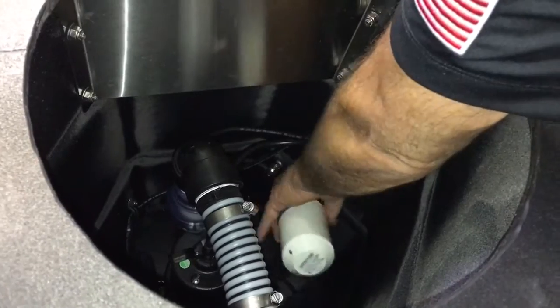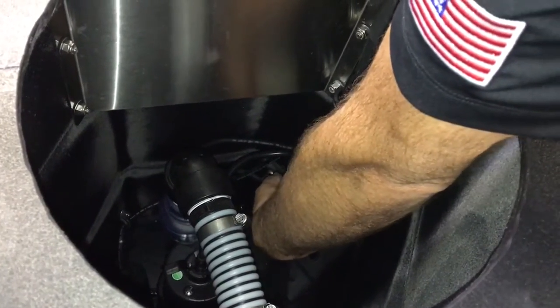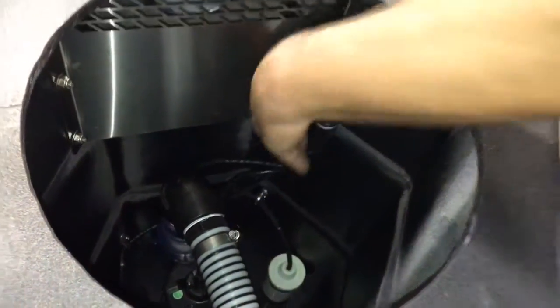On the right here, this is a shutdown switch. It is wired into the vacuum system itself, and if for some reason the pump out fails or can't keep up with the volume, to prevent the water from overfilling and running through your vacuum blower, it will lift up and kill the engine on the vacuum system itself.